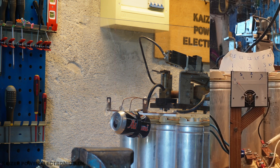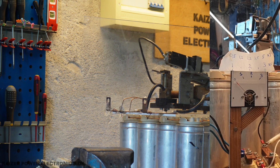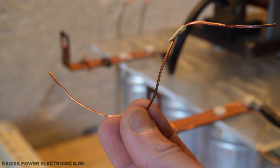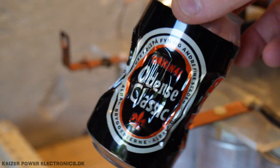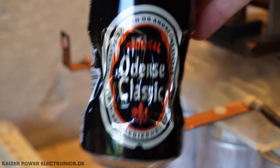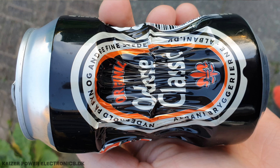Can crusher is in place, charging to 2.5 kilovolt. Removing charger. Discharging in three, two, one. A few highlights from the can crushing: I only laid the copper wire to rest on the two bus bars here, wrapped two times in one spot and four times over here. There's just shrapnel everywhere. The can itself — not as good as expected, but a pretty even and very nice crushing overall. I'm satisfied, though I'd probably need to secure the work coil even better.